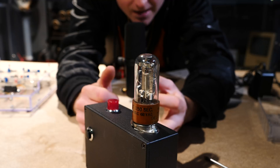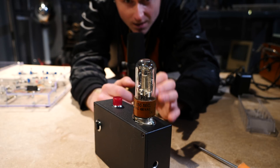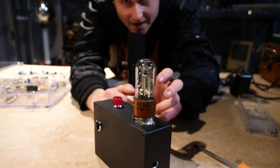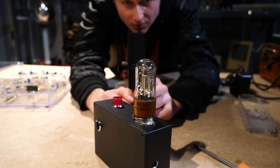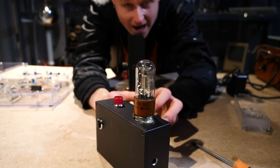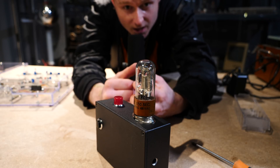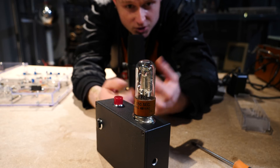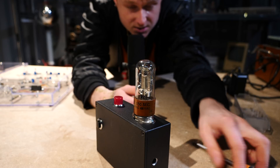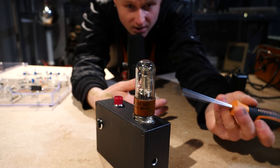What kind of applications would these delay relays be used for? Well, quite a lot of the time they are found in valve items that can be damaged when cold and high voltage is sent into the valves. This enables all of the heater filaments inside the machine to heat up as it's turned on before the rest of the circuit is functioning — it kind of just gives the heaters a head start, heating up accordingly to the time required for the machine.